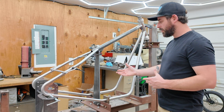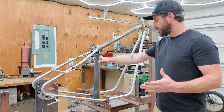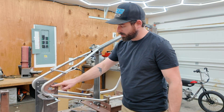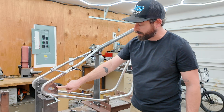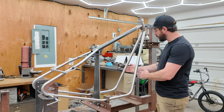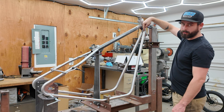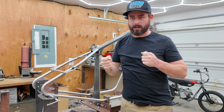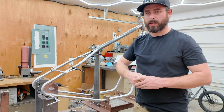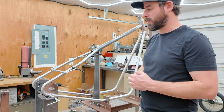In this episode I've shown a couple of my tricks: leveraging the ability to easily design and laser cut the flat plate for the axle blocks, how I put the axle plates on the axle block, incorporating the tapping hole into the adjuster block, and also being able to design that tool to cope directly on the frame jig instead of in the vice — measuring, being unsure, getting it wrong, and wasting tube. A lot of it is just peace of mind, and peace of mind while building really helps the whole experience and affects the outcome.